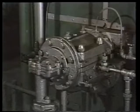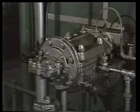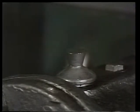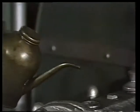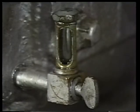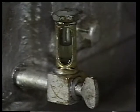Now that you know how the oil lubricates the bearing, let's talk about how you make sure there's enough oil available to keep it lubricated at all times. The housing for an oil-lubricated bearing usually contains a quantity of oil. Most of the time, you'll find an oil level indicator placed outside the housing to monitor how much oil is there. When the level gets too low, more is added. Many housings just have an opening on top — enough oil is poured in to get the level back to normal. This type of housing almost always has a sight glass mounted on its side to monitor the oil level.